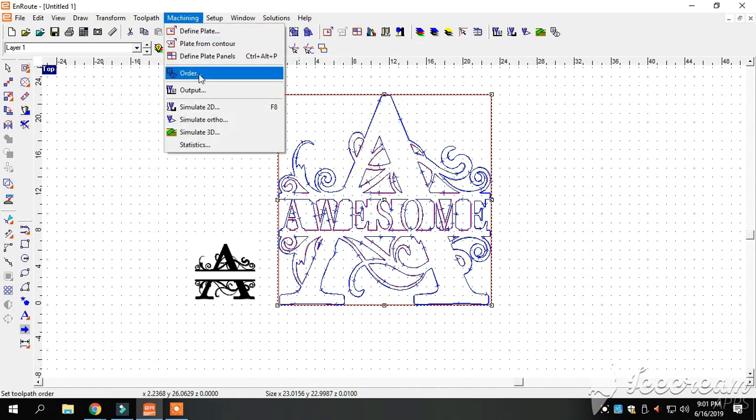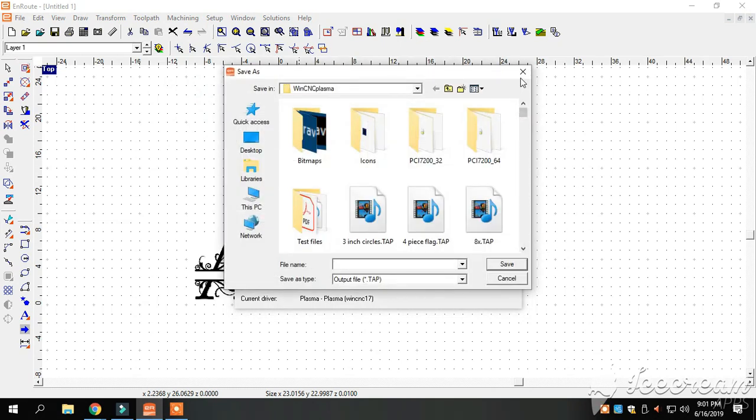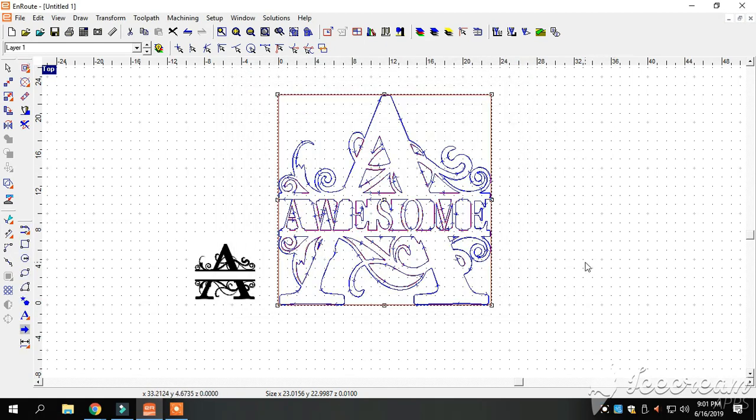When we're at this stage, we go to Machine Output, send it to file, name it what we need to name it, and it'll be ready for the cutting table. We can run it on the CNC Shop Sabre Sidekick 8. Just a little video filling you guys in on how we go about the drawing process. If you like what you see, make sure you subscribe to our channel, hit that like button, and check us out at Shooter Option Targets / SLT Metalworks on Facebook, or SLT Metalworks on Instagram. Guys, it's been an awesome night — thank you all so much for watching, and we out.